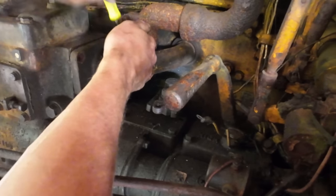Down at this end, I did the same thing. This pipe stops just below flush, so we have a slight counter bore there basically. And I just took that exhaust compound and cut a little bead in there and tried to fill up any gaps so that we can't suck air between this packing and that pipe. It's a pretty snug fit. I don't think it would really suck much there anyway, but that ensures that we don't. Yeah, buddy, going up.